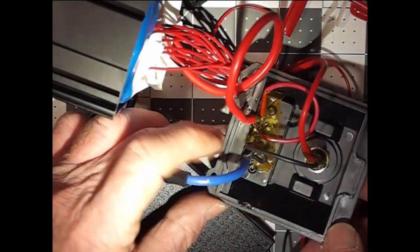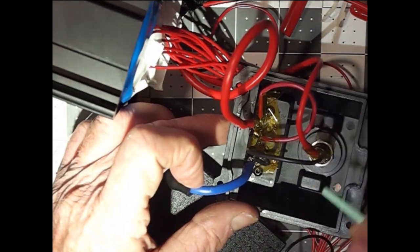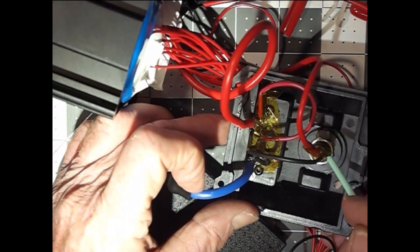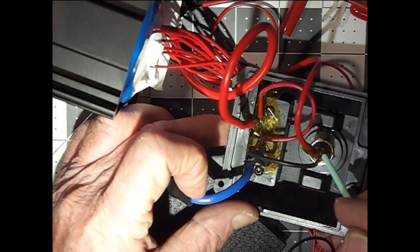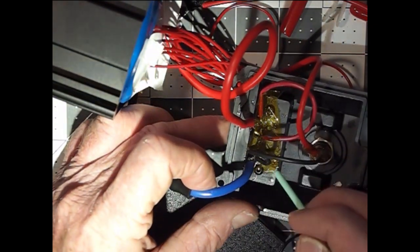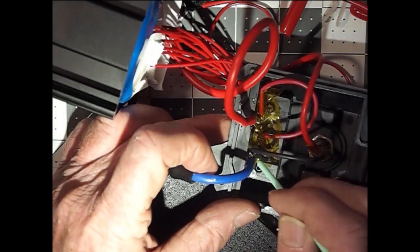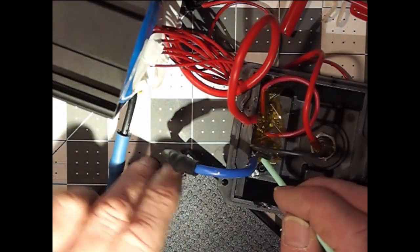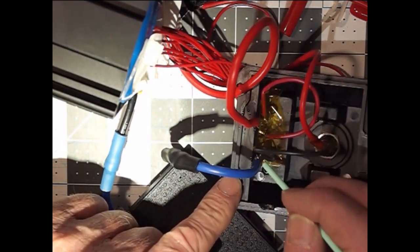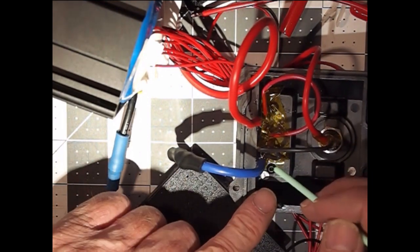So now show the wiring connections for the end piece. So the red charger wire is going directly to the center pin on the charging connector on the end of the battery pack. I've got a negative lead going over to the B pin on this connector, and then I've got the B pin shorted over to the main lead, where we've got the output from the BMS as well as the input from the negative charger lead to the BMS.